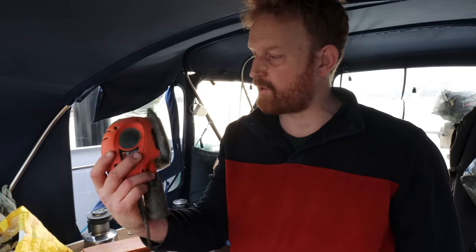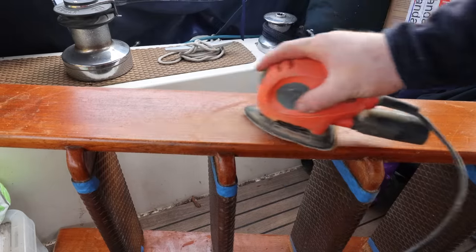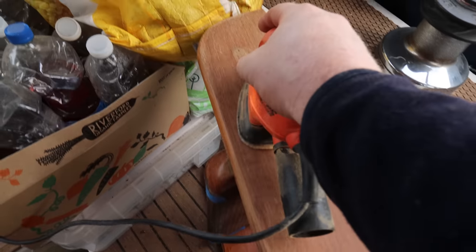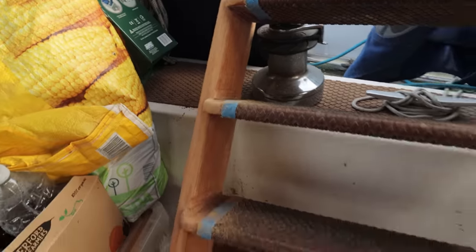However, the steps don't appear to be teak veneered, so they look like they've had a pretty tough life but can take more abuse. Rather than keep gently sanding by hand and using the varnish stripper, I'm going to get the mouse sander out with 40 grit paper and really push into this — one Black and Decker mouse sander and we're going to go hard. She's starting to look a little bit better — I think we managed to bash most of the varnish off.